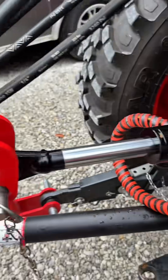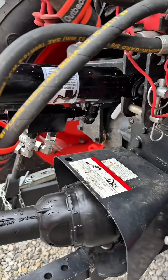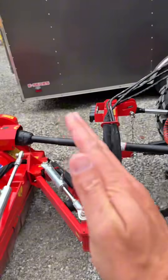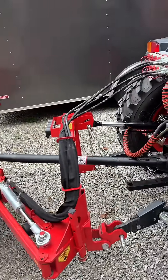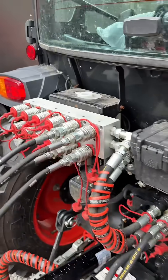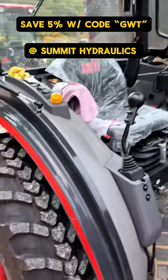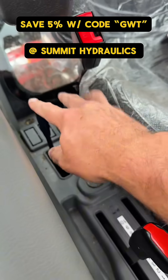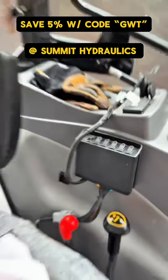This right here is a hydraulic top link. It replaces your manual top link and allows you to make adjustments to the angle of whatever's on your three-point hitch from the operator's seat. You do need to have a rear remote in order to use it, and then you'll have a lever to operate that rear remote inside your cab, like one of these two. This has two rear remotes plus that multiplier, which has our switch panel there.